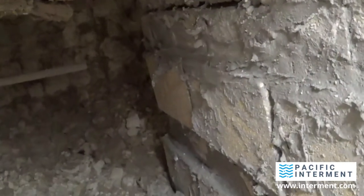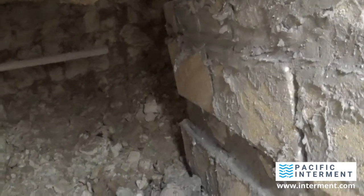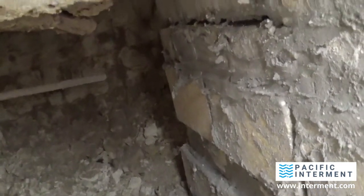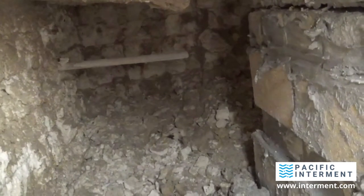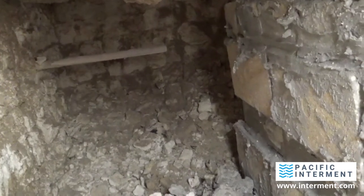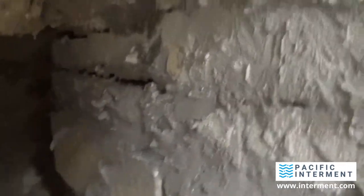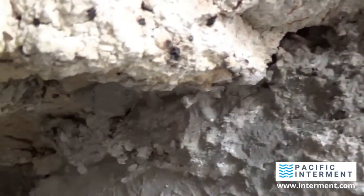That is the wall. As you can see, it doesn't go all the way to the very end — because remember, these gases have to travel through this side and then turn the corner and come back around. That rod that you see there sticking out, that is the thermocouple for this machine. And that's what allows it to read the chamber temperature when it's running.